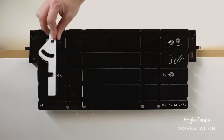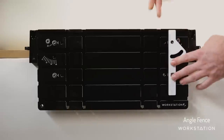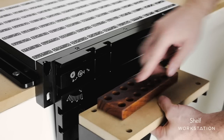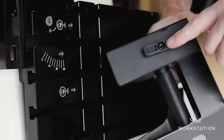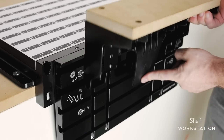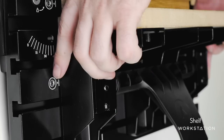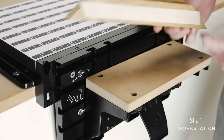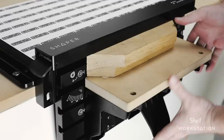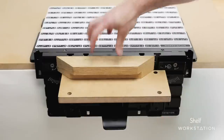To provide flexibility, we've got the alignment pins on the right-hand side as well. You can flip and rotate the angle fence 45 degrees in the opposite direction and have two setups or more ranges of angles you can use. Here's the shelf. This enables us to quickly clamp things in place and work on small awkward elements quickly and efficiently. It's set up with T-slot attachments that fit in these channels, combined with a quick-release lever that has three positions: the lowest is free floating, the second is a little firmer, and the final position is fully clamped. That enables us to very rapidly get elements ready to go.